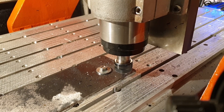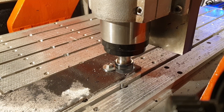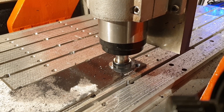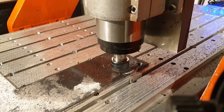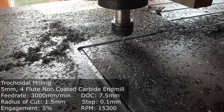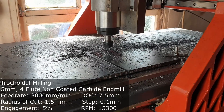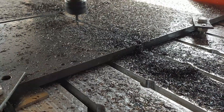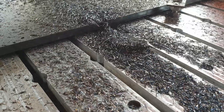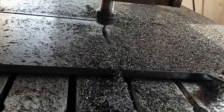The cut actually came out really well. However, if I'm doing this again I'm definitely going to be using a bigger diameter cutter - a 4mm cutter is just scary to watch. I'm much more comfortable watching a 5 or 6mm cutter do the exact same thing. I'm going in with a 7.5mm depth of cut here, though I probably could go a little deeper as the CNC didn't seem to have too much of an issue. This is an uncoated end mill - a coated one would be better, but I'd destroyed all of those. The material removal rate is better than previous parameters, and the chips are probably the best I've come across with my setup.